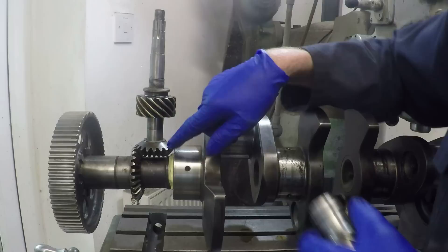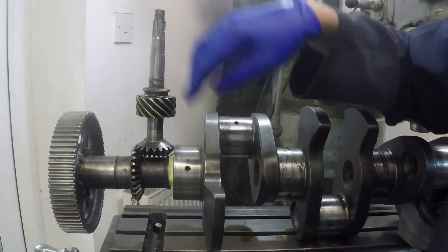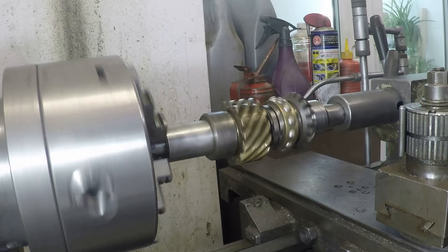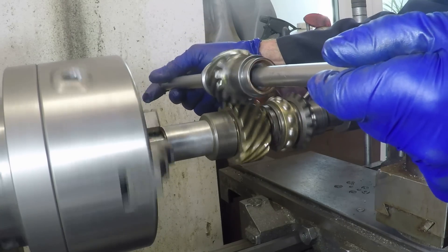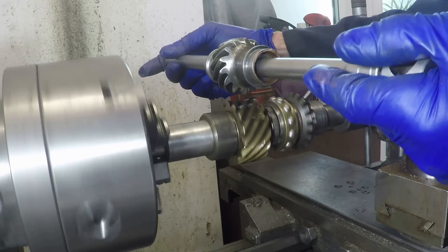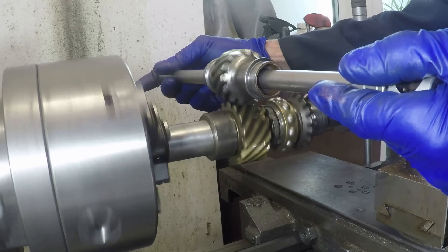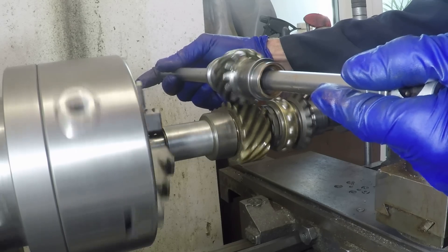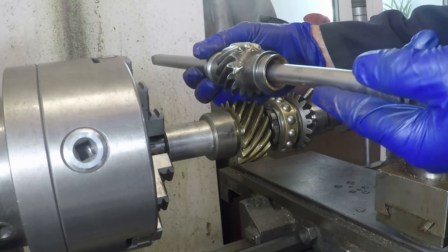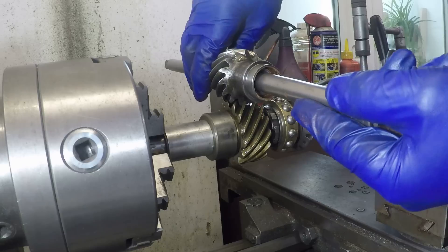The upper vertical drive shaft has a bevel gear onto the main drive shaft out of the back of the crank, and this gear here is the first stage step-up drive for the supercharger. The first thing I'm noticing is a certain amount of push towards me, and the greater the torque you carry through these gears the more that loading is going to be. You can also see that the teeth are obviously rubbing together as they go around, so it's slightly different to a set of straight cut gears — you can see the action of the teeth sliding against each other.